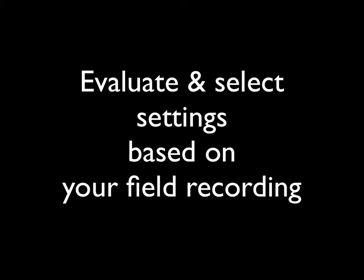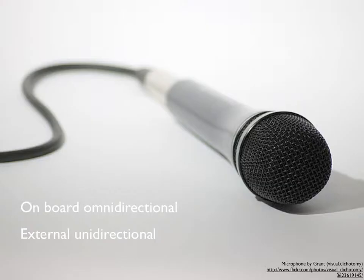Let's talk about different available settings you can use based on your recording needs. On the top of the audio recorder, you will see two microphones. These are omnidirectional microphones, meaning they'll pick up sounds from all directions, and because there are two of them separated by space, they will create a stereo recording that recreates where sounds were generated. This is useful if you're recording a meeting — by placing the audio recorder on the table, you will be able to hear where each person was sitting. If you use an external microphone, it is unidirectional, meaning it only picks up sounds from one direction — directly in front of the microphone. This is useful in loud environments when you want to isolate a single sound source.